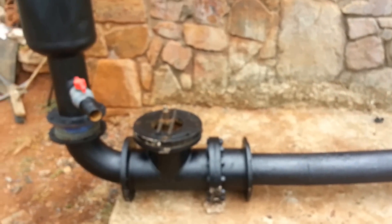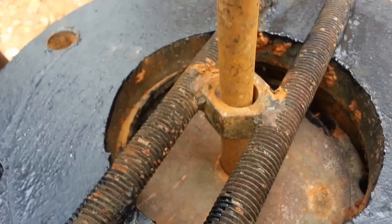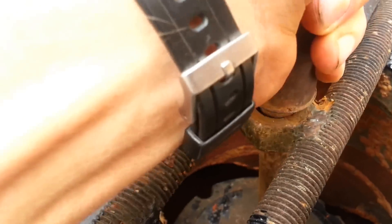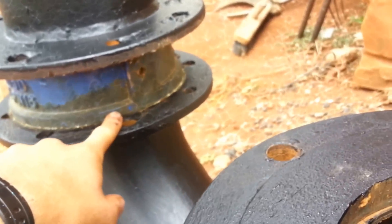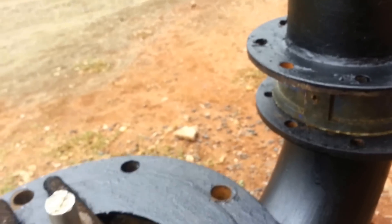That's basically the pump. This is the ram effect — I still need to weld the end so it doesn't come loose. When it does this, the non-return valve will open and it'll flood until about one bar, then I'll open this and the water will come out. That's basically just two moving parts and you have your own water for free, no cost. Just remember to drill a small hole for the air to come in — very small, don't make it too big otherwise you lose pressure.